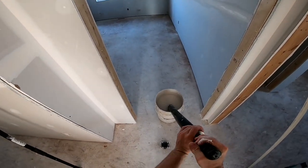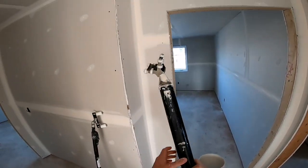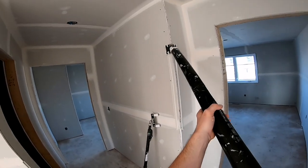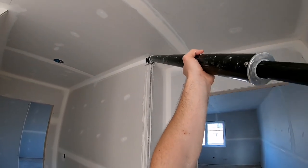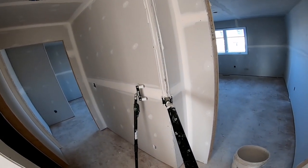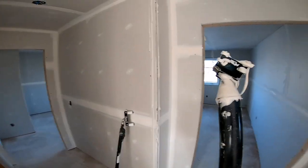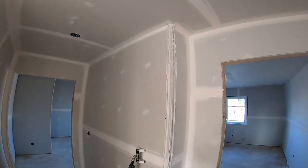Let's put some mud onto the corner bead. It just fits in there, and as you can see the mud will come out that hole, that hole, and that hole. I'll start in the middle here — put it on. You want to make sure you're getting a good full coat of mud. Get it right up to the top and give it a little push. It does drip a little bit; this isn't the cleanest method, so after you're done you might have to do a quick cleanup of anything that dripped on the floor. But the time for a 30-second cleanup is nothing compared to the time savings of using this.